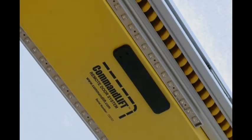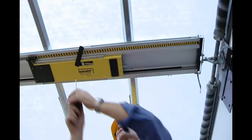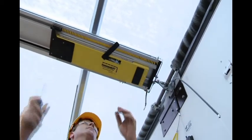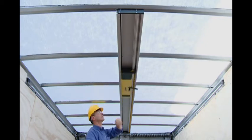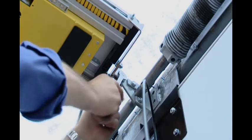Open the black access panel on the motor unit and you'll see a metal lever. Insert a screwdriver in the hole on this lever and pull the lever towards the roll-up door. This will release the motor unit and allow it to slide freely along the track so you can continue to drill the track. Slide the motor unit by hand along the entire length of the track. Watch and feel for obstructions during travel. Make sure the fastener heads are not too large and the track joint is smooth and secure. Once the track is secure and straight, tighten all the nuts and fasteners at the header bracket.